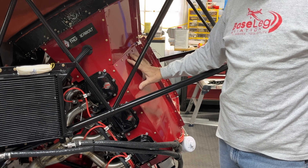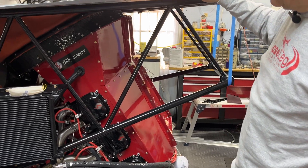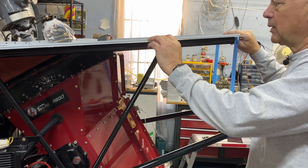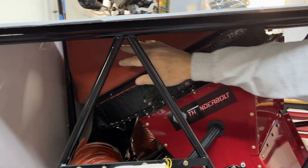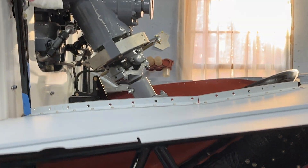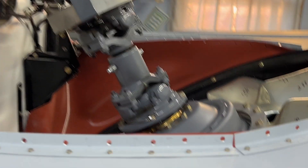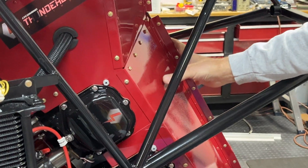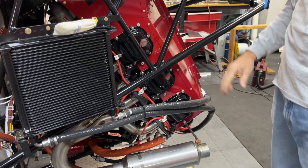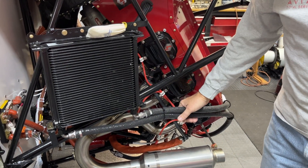The baffling has now been painted and completely installed — no small task. I'm making the top inlet bulkheads; I still need to get these painted but it's been a little cool so we're hopefully getting the paint booth ready today. The rubber baffling makes sure all the air gets sucked in. You can see the fan on the engine — that's actually blowing the cool air, taking the place of the propeller. It blows all the air down into the plenum on the top side and out through the bottom, just like an aircraft installation — a downdraft air-cooled engine.